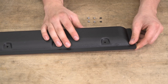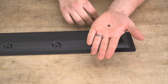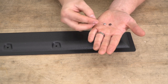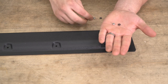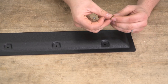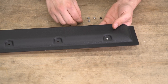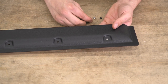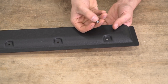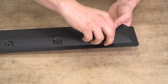Using the hardware included in the kit — there are O-rings, backing nuts, and the Torx screws that go in. What we're going to do is put a backing nut through the hole, then put an O-ring onto the screw itself, and get it started by hand. These are pretty small, so just be careful not to cross-thread them.